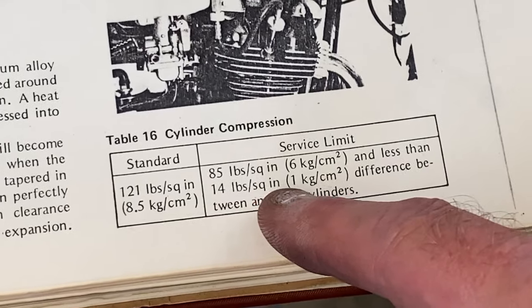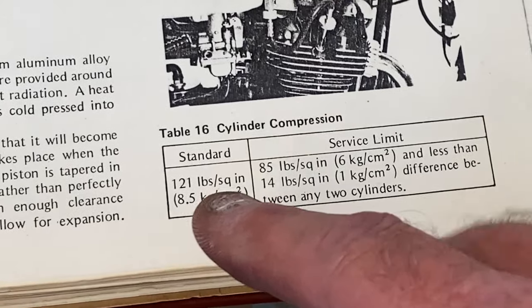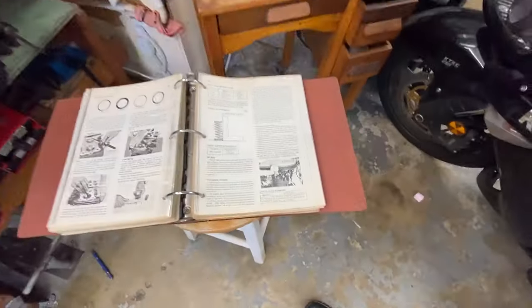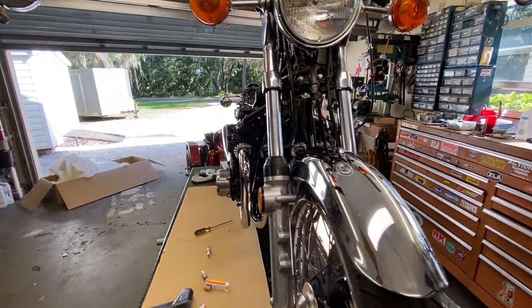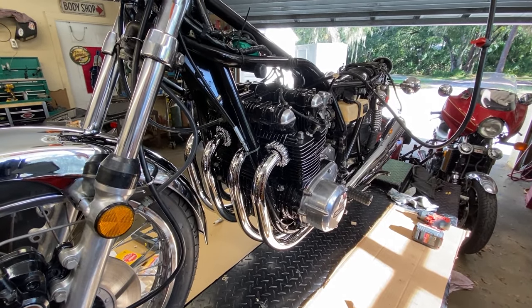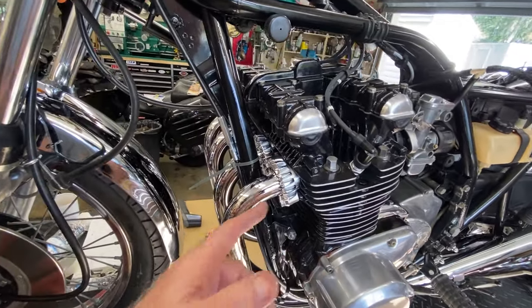I always go off 10%, which would be 12 PSI. We're at 118, 120, 118, 123, and 120 on number four — right there per the service manual. The valves are probably sealing okay, but that white powdery-looking material is definitely oil: whitish, yellow, tannish. I could see it on a couple of cylinders with the borescope. I've started it up cold a couple of times and it's just gone a little puff, which indicates oil is leaking down into the exhaust chamber.